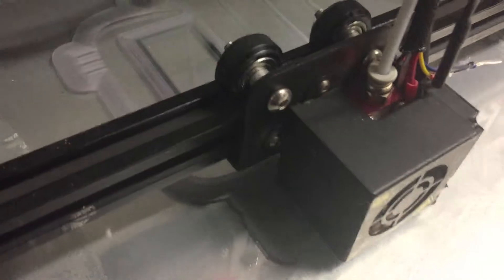This is stage one and I'm using this silver PLA that I bought on eBay. This is just a quick go at the start of it. I used to use glue on it, but now I just try to do it direct onto glass. There's no real benefit apart from a bit of a shiny surface on one side, but I might end up using the glue again as it does seem to hold a bit better, and you can get away with a smaller brim and things like that.